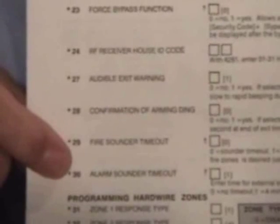Let's take a look at line number 30, the alarm sounder. Honeywell has programmed the siren to play for four minutes, which is usually enough time to wake you up if there's a problem, intimidate the person out, and allow the control to call for help. Once that's done, it will shut itself off, reset, and go back to protecting. But if you have a neighbor close by and want to increase the siren to 12 minutes, you go to line 30 and enter a number 3. It will beep to acknowledge your entry and advance to the next line, number 31.